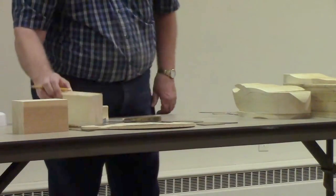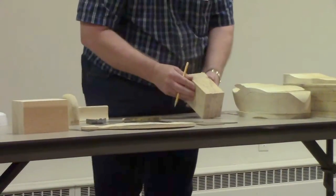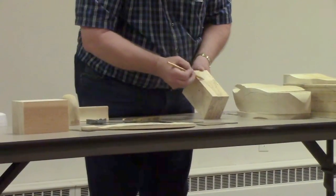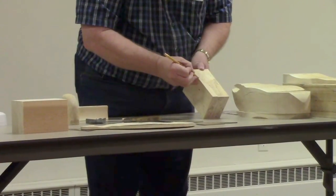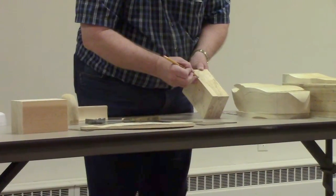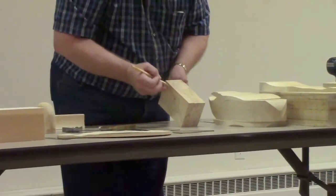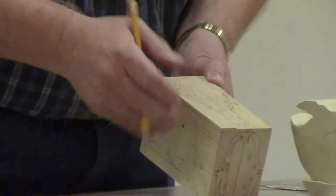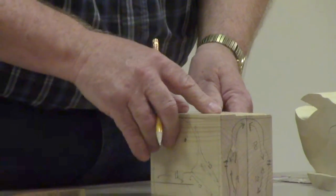So then once you have that all chased on there, just looking at my cuts here, the way I typically go chase it around, I'll do my top cut first on the head. I'll leave a little gap here so the wood doesn't fall off. I want to keep the culls on here to keep the pattern intact. I'll leave a little gap so it's kind of like I got cut 1, 2, 3, 4, 5, 6, whatever it is. So I'll have all these cuts.